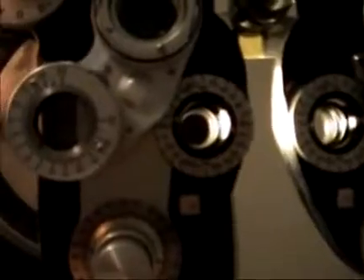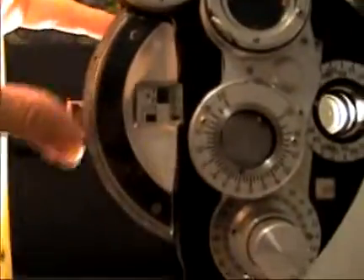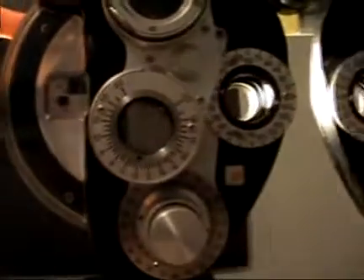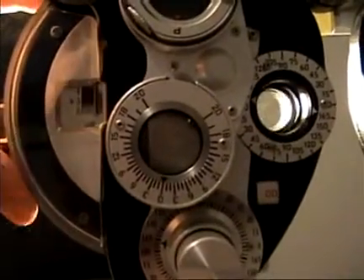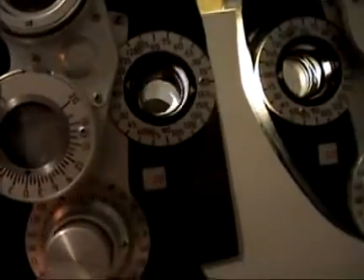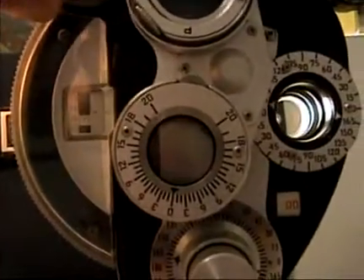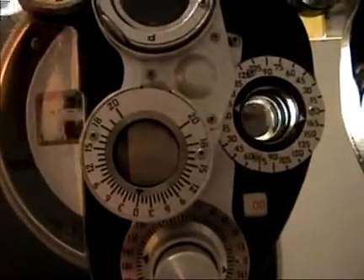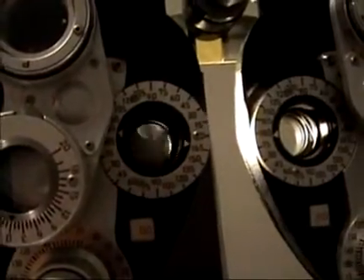Similarly, the sphere lenses for nearsightedness and farsightedness — the red ones being nearsighted correction and black ones being farsighted — up to minus 1.0 and up to plus 1.75, you can clean these lenses on both sides. The three-diopter changes can be cleaned in three-diopter increments, again on both sides. The auxiliary lenses from this knob — you can clean these ten surfaces on both sides by operating this wheel separately.